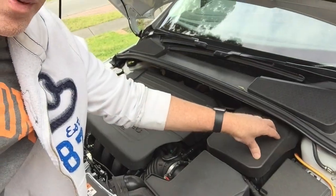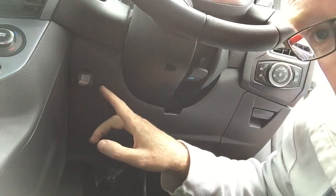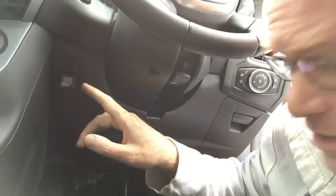I've got a master system up in here and then slave systems behind each of the cameras. That gives the car enough processing power to actually understand what's going on with the vision. So here on the inside of the car, I didn't have to do a lot really. I did want some feedback from the system, so I've taken a small OLED screen — it's a SmartView Arduino system, great for little outputs. It's taking a feed off the control system and putting it straight into here, and there's a full Arduino chip behind that screen.